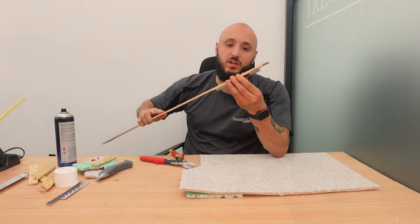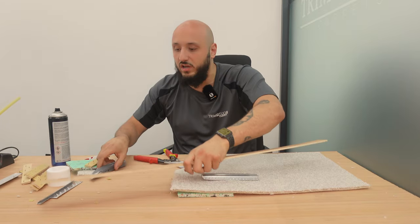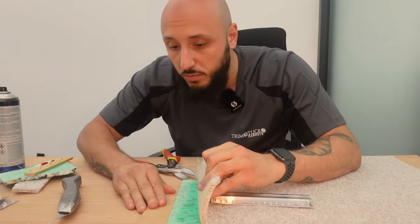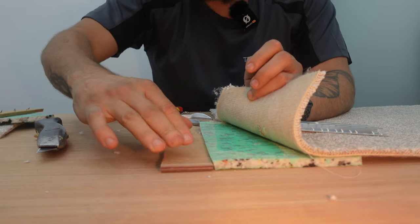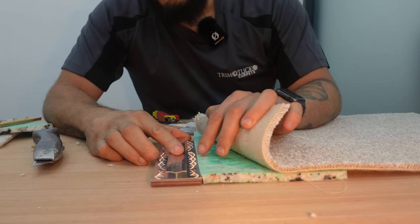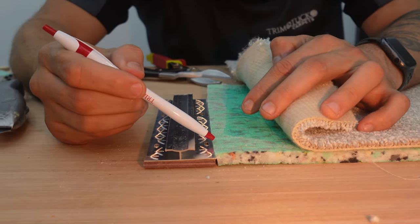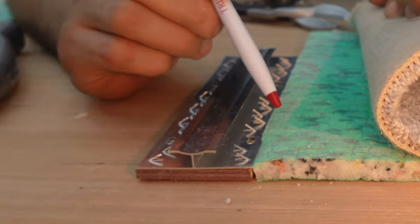This is basically what we use to raise the bar. It's very universal and generic - it can work for a lot of carpets because generally the underlays are 10 mil. If it's higher than that, we'll use something a bit thicker. So now we have a bar that we're going to raise. We'll put the ply there, glue it down, and put it in line. You won't need to glue it on site - obviously it will be screwed or hammered down. Then we'll glue the bar on top.